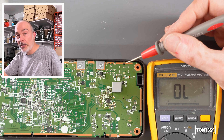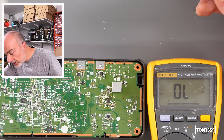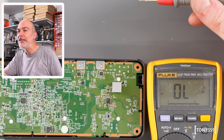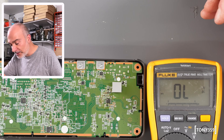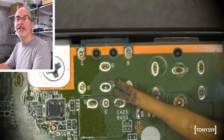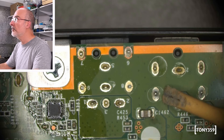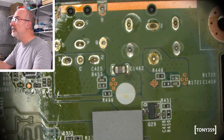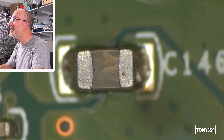There is a capacitor here close to the power connector and that's a short. To be honest I think I can see something on the capacitor. Is that going to be the simplest and fastest repair on the whole channel? Shall we have a look under the microscope? This is the DC-in connector, this is the DC-out — because this also has a facility to connect something else — and I mean, that's a broken capacitor to me.